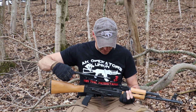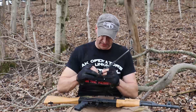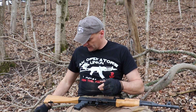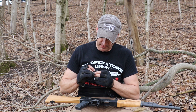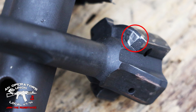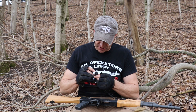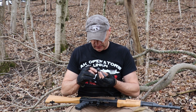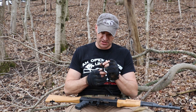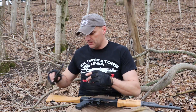Pulling out the bolt carrier for a look — there is deformation and some things happening on the bolt. I'll take detailed pictures and post them so you guys can see. I can see metal discoloration right here, and there is freshly shaved-off metal from the bolt. The bolt is chipping a little on the bottom. On the locking lug — hard to tell fully right now; I'll take detail pictures and track how this progresses.